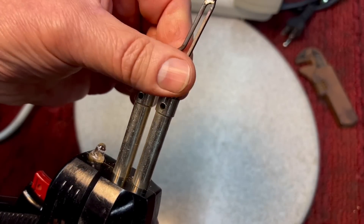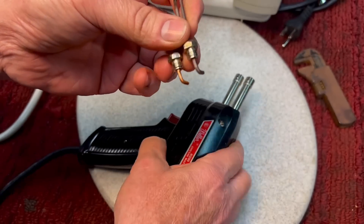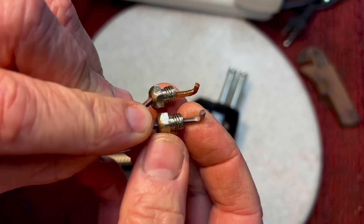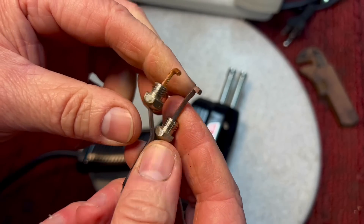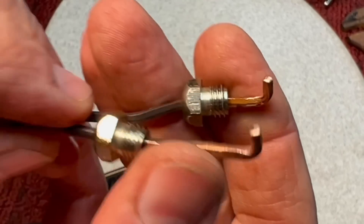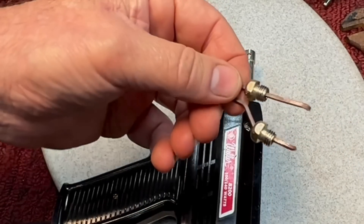This is one of the reasons why this little meter will come in so handy in your shop. Let's take the tip off, clean it, and put it back to see if we can get that wattage up closer to what it's rated for. We loosen these nuts with a wrench — this just pulls out. You see that little bend goes in these holes. We're going to clean all this with a hand wire brush, especially in there — you can see there's a little bit of oxidation on the inside. We're going to clean all that out, make it bright and shiny. You could use emery cloth or anything to make it bright and shiny and get rid of any oxidation.